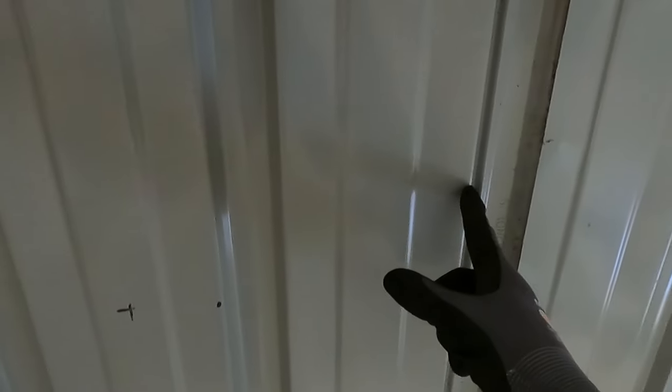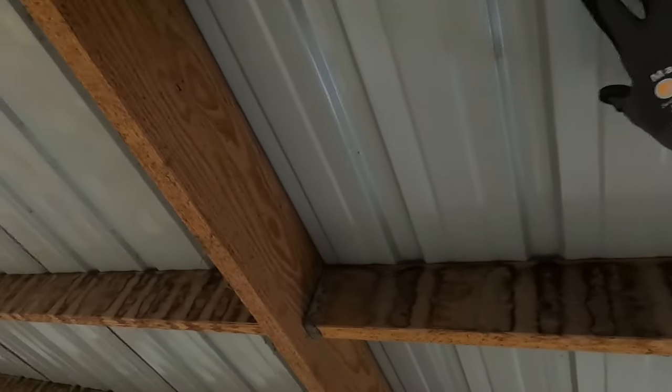The flashing piece will be between here and here. The flashing is 24 inches wide, 24 inches long, and it's going to fit right here. I'm going to make a little box frame right here so the flashing has something to be fastened to.